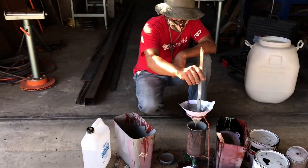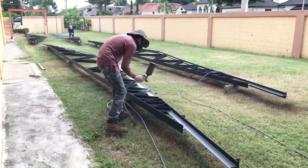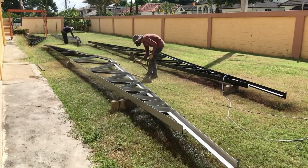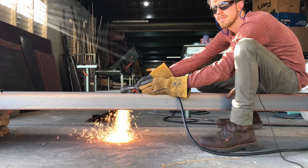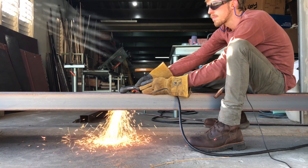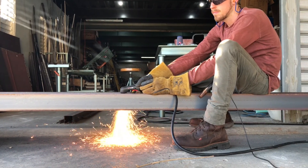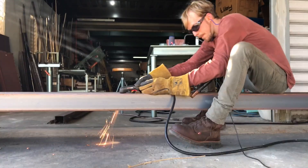I am incredibly impressed with the refrigerant air dryer — it has solved all the moisture issues in the compressed air. This one is rated for up to 40 CFM. I haven't conducted a precise test for the exact amount of humidity still remaining, but it seems completely dry, good enough for most any application I know of. I may do further testing in another video if there is interest.